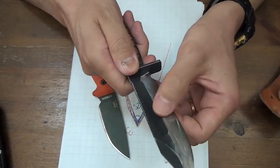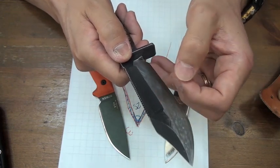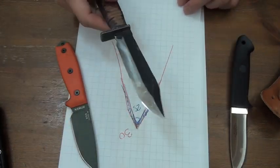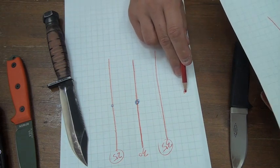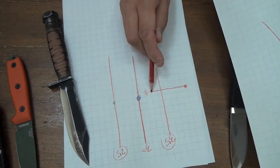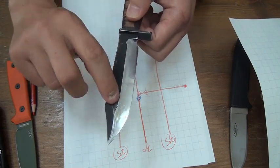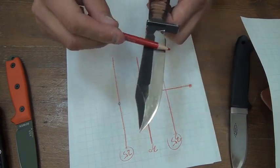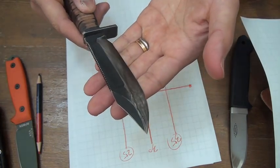This primary bevel, saber bevel - from here to the edge was 30 degrees. And this secondary edge from the factory is ridiculously large - 40 degrees. Only talking about this one - 40, out of the sharp range. So I must get this 40-degree edge back into the sharp range. So I did a full height grind - not full, from the transitional grind to the edge, totally. I got it back to 30. But this 30 edge has a genuine scandy edge, zero grind - not tough enough. So I put a microbevel on it and it's now 35, just under 35, around 33 or 34 maybe.